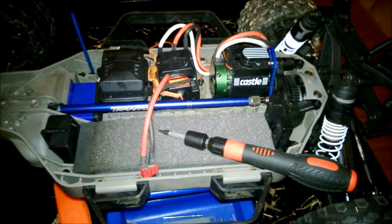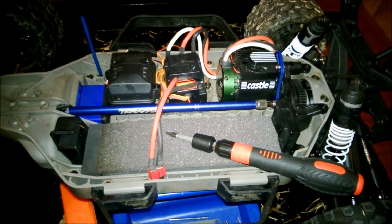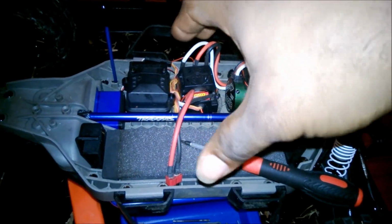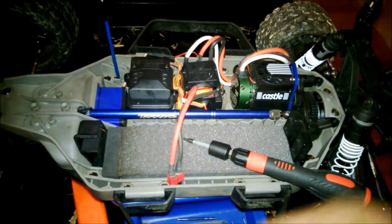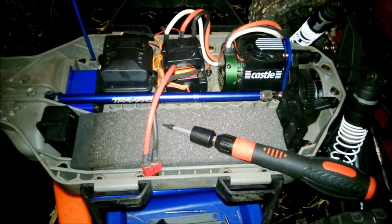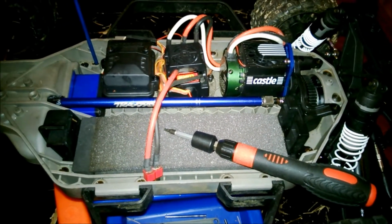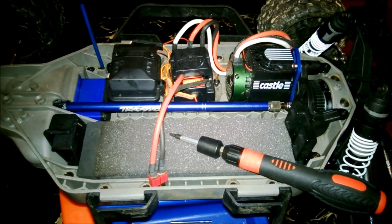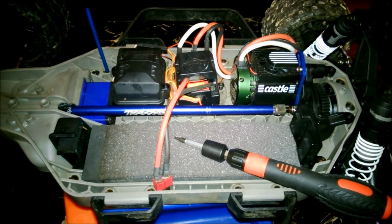But the overbody tray seems to be a completely different story, because that forms a cap that sits on top and keeps the large debris at least from getting inside. The downside with that thing is that it cuts off a lot of air cooling, and running high power plants, you produce a lot of heat, so you need to have airflow coming in for cooling.